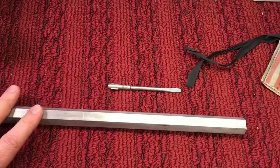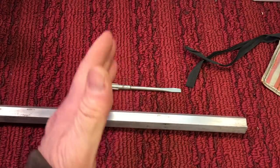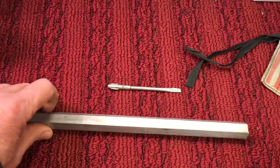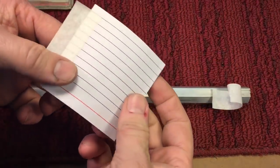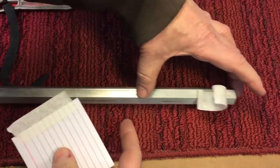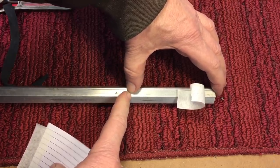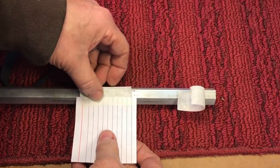I love hex stock — it looks so classic. The first thing I'm going to have to do is cut a piece off of here. I want to show you how to cut a piece so that it's fairly square. Because normally, for some reason, hacksaws have a tendency to want to drift one way or the other and give you a kind of an offset cut. So I'm going to show you how to make a pretty square cut with a hacksaw. First thing you're going to need is an index card or any kind of card stock, even a piece of paperwork. Figure out about how long you want your shaft — I don't do too much measuring, but I know what I like.